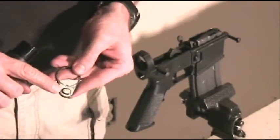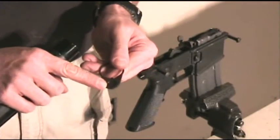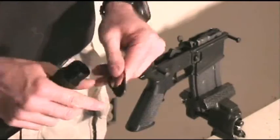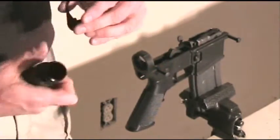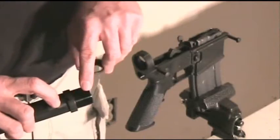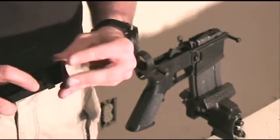Place the lock plate onto the buffer tube, ensuring that the protrusion side of the lock plate faces towards the receiver. As you slide that onto the buffer tube, you'll notice the small tooth protruding into the center of the ring will index onto a recess on the buffer tube.